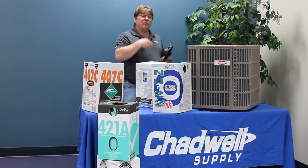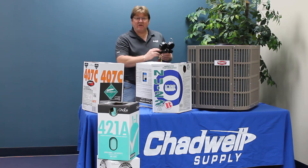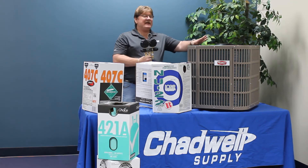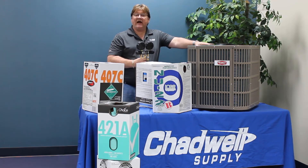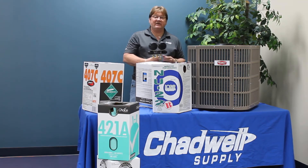When I get to about 90 percent — going to about 80 ounces — I shut it off and give that refrigerant I put in there some time to equalize out in the lines. Once I've waited two or three minutes, I'm going to energize the system.